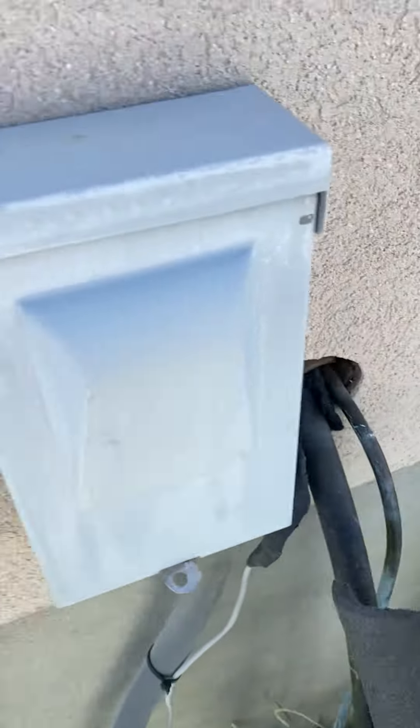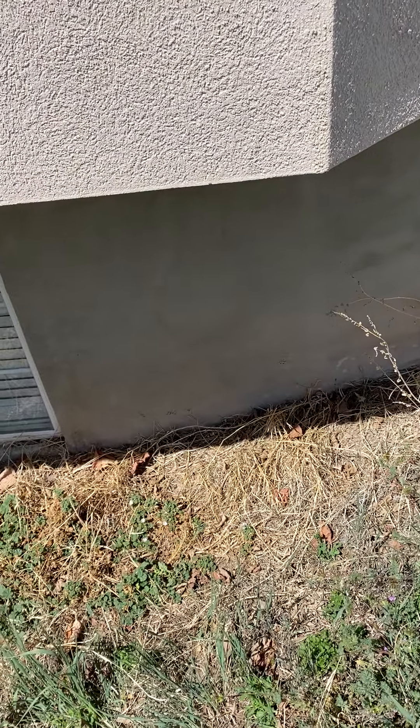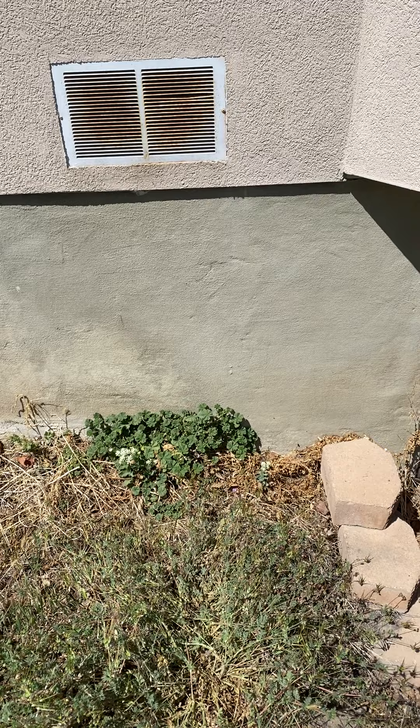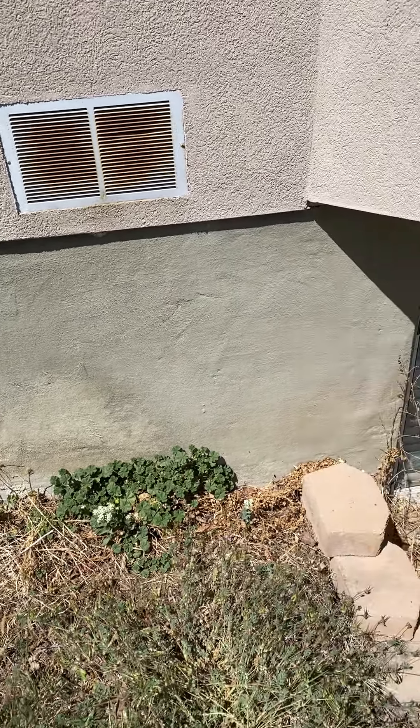This is 7H 3H. I don't know why I saw daylight out of there — there's nothing here but there is a bay window. On this flue, you may have to take the siding off depending on what you run into; it might be this, and then a header up inside here that you have to go through. Oh, I'm on the wrong window — there's a combustion air right there. So we have to be a foot away from that combustion air. Never mind about that side.